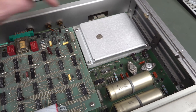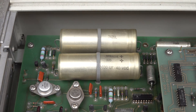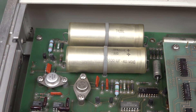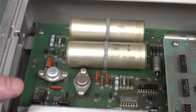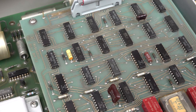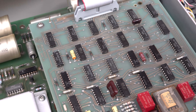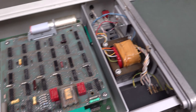We've got a mysterious metal can down here with our card edge connector. Some gorgeous looking Sprague capacitors for all you Sprague fanboys — 2600 microfarad, none of that 2200 E12 type rubbish. We've got what looks like some power transistors down here on standoffs. And maybe some Zeners and diodes, and as is common in HP gear, you'll find the custom part numbers. These could very well be standard 74 or 4000 series CMOS chips, but they've all got HP part numbers on them. Very, very common. We've got a couple of relays.